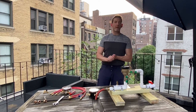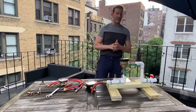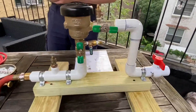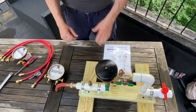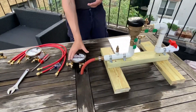In this video, we're going to show you how to test a spill resistant vacuum breaker ASSE 1056 using the ASSE 5000 series test procedures. There are test procedures using three hoses and three valve kits, but today we're going to be using the one hose version, which came out in 2015 in their new handbook.